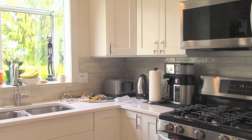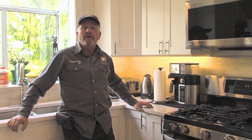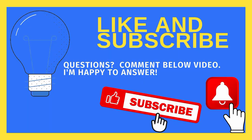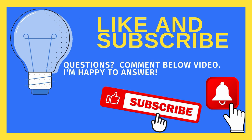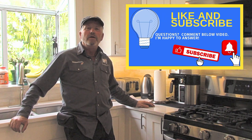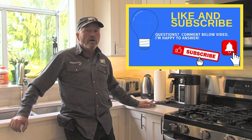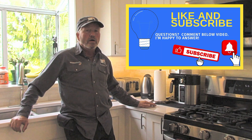It looks like the higher the number on the brightness level, the more light that they will turn on with, and the lower the number the darker it'll be before they turn on in the kitchen. I've set it for about 2 right now with just 30 seconds for testing, but I know where the settings need to be so I'm going to put that face plate back on. Now as I enter the room you see the lights came on and all seems to be working well. That's another project done — thanks very much for watching. Please hit that subscribe button, click the notification bell so you'll know when I release a new video, and please leave comments below. I answer them once a day, and you can also suggest video content you'd like to see. Thanks again for watching — I am your internet electrician, Terry Peterman, until next time.